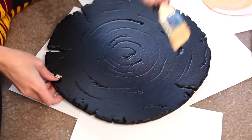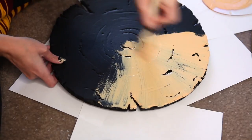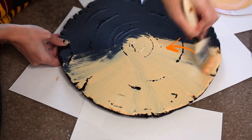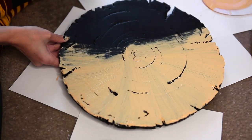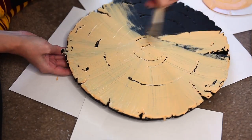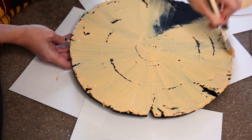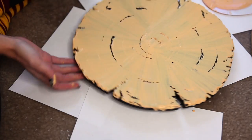To apply the first coat, I brush the paint on perpendicular to the direction of the carved lines. So since the lines are going this way, I apply the paint in strokes that go this way. This cuts back on accidentally filling all the details that we intentionally carved in there. If you did get some paint in these deeper recesses, it's no biggie, but this should stop tons of paint from pooling in there.